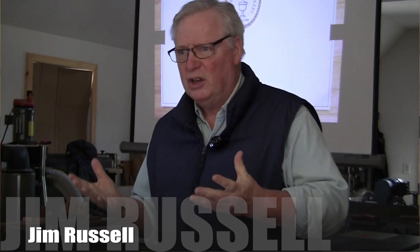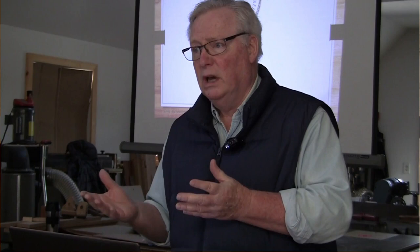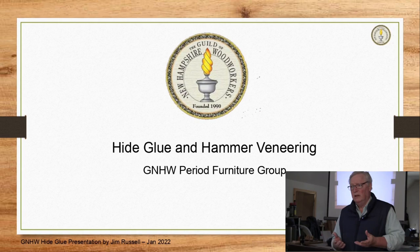This talk's about hide glue, and it's about hammer veneering. Hide glue is the vehicle. Hammer veneering is one of the many things that you can do with hide glue. The real choice when you're choosing to veneer is you either hammer it or you press it. And you can press it mechanically or you can press it with a vacuum press.